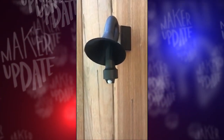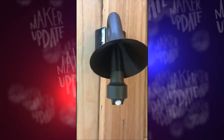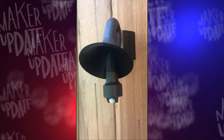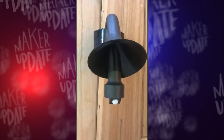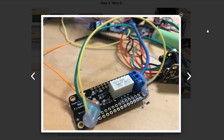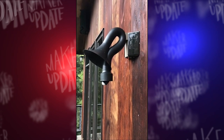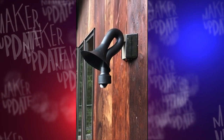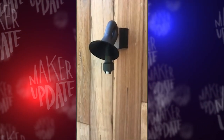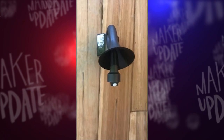On Instructables, Rabbit Creek has a guide on how he created this motion-activated, solar-powered bird call speaker. He calls it an Electric Thrush, named after the type of bird whose calls he's loaded into it. The design is a crazy 3D printed horn with a PIR sensor coming down from it — it almost looks like a bell with its clapper hanging to one side. For the electronics, he's using an Adafruit Feather with a Music Maker FeatherWing and a relay module. The Music Maker is loaded up with recordings from the Cornell Lab of Ornithology. Once the motion sensor detects something nearby, it plays through its library of pleasant bird chirps. There's no reason you couldn't modify it to play the Star Wars Imperial March or the sound of an audience applauding as you walk by. It's a totally self-contained, solar-powered project that you can put anywhere.